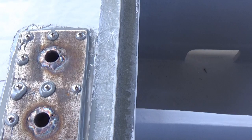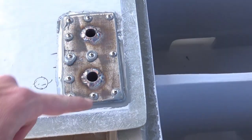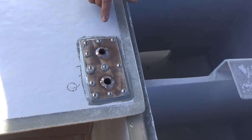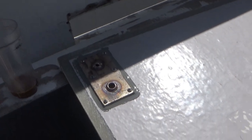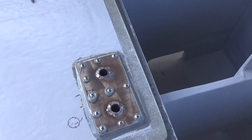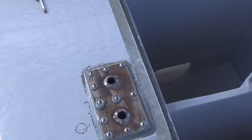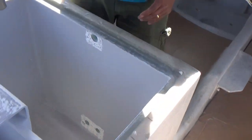We're here on the timeout. Looks like we've got the fuel return lines and vent. This is a fuel return line and a vent. That's the vent and return for the generator. And this is the supply coming back from the main tank to the day tank. And this is the pickup right here that we still got to install.